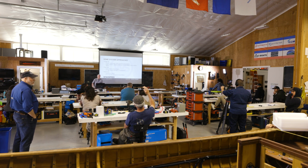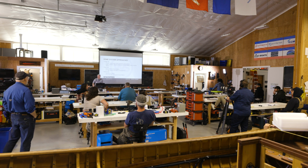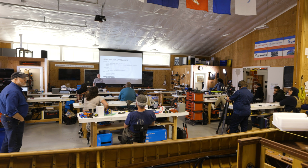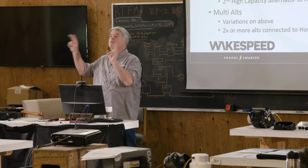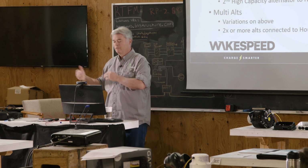So, to Kevin's point, could you put a cap in amps on this, 20 amps? 20 amps. Victron makes the Orion 20. You're talking about the rating of the DC to DC converter? Correct. Make sure you're not overloading. I don't know what the spec on that little guy is. I might put a 10 amp on it, right? But this is for getting 20 amps or so to the house battery, 12 volt amps, right? 12 times 20 is 240 watts, so 200 watts to the battery, right?